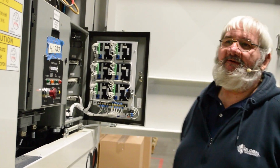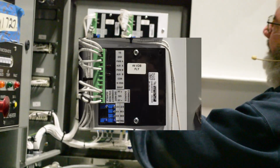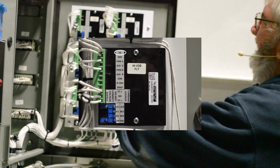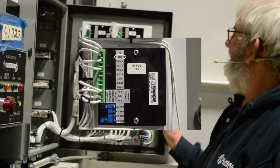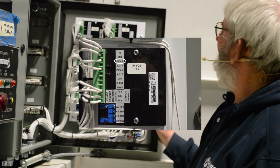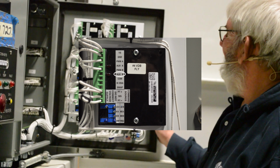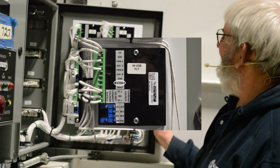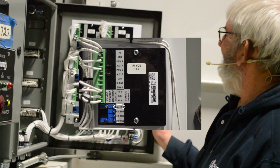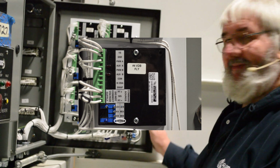The first thing that you want to do is familiarize yourself with the PQ board. On the PQ board, it's marked VS, which stands for voltage supply. Next terminal down would be ground. This would be the system ground. Next terminal down is PWA, aux A, PWB, aux B, and COM, high ENA, swamp, PT plus, signal, PT minus, and then you have your low A, low B, high A, high B, ramp, and frequency.